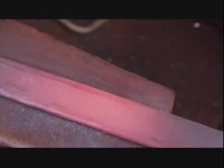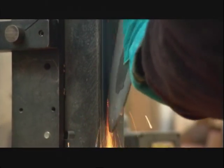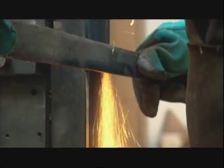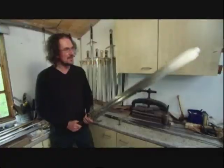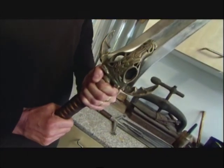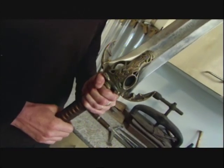Once compacted, the blade's ready to be ground. Grinding is just refining the shape, removing as much stock as you can afford to without compromising the integrity of the blade. You want this to be as light as possible, because the guy that lasts longest in battle without getting tired wins — it kind of breaks down to that. Not everyone gets it, though. I've been asked to do a couple of ridiculous things in my time, but this is about 20 pounds of steel based on one from the first Conan movie. There's no way you're going to be able to fight with this — you've just got to wait and hope that somebody falls underneath you and it drops on them.